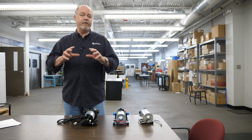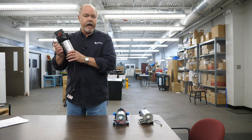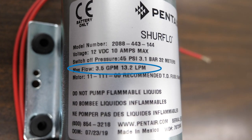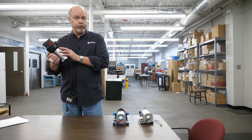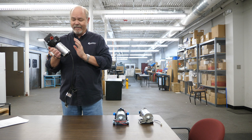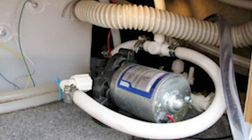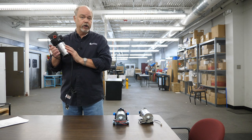The pump output rating is very important to understand. When you look at the gallon per minute rating on a demand delivery pump label, that rating describes how much water the pump outputs at open discharge — not hooked up to anything, no elbows, no tubing, no back pressure, strictly blowing water out. Once hooked up and running at pressure, you need to consult the pump curve, because the higher the pressure required, the less flow you'll get.